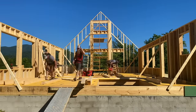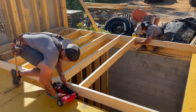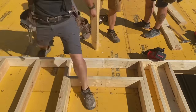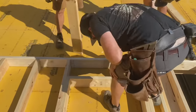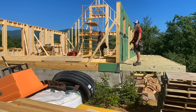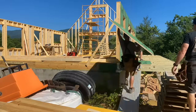With all of our deck framing now done, it was time to rock and roll with the rest of the walls on this main floor. This gable end wall, even though it's exterior, is not load-bearing, meaning none of the weight from the floor or roof above will sit on this wall. For that reason, we don't have to use the giant headers like on the other walls — we can just use a double flat 2x6 and some cripples. We realized we were about to lose our access to this whole platform by standing this wall up, so we moved our walk plank and put down some temporary decking to the future front door so we could get in and out once this wall was stood.